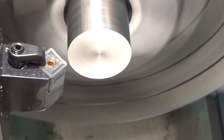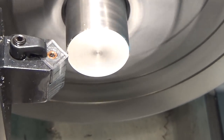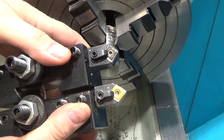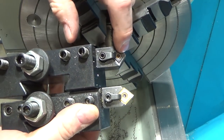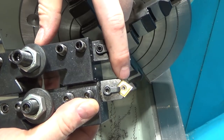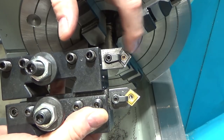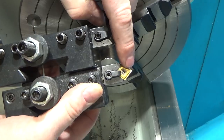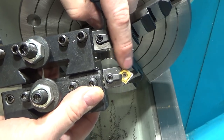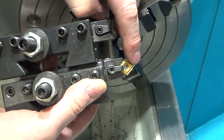A little bit of chamfer. By the way, if you're interested, I have two different style chamfer cutters, different angles on each. And the advantage of this one is if I ruin the tips, it's the same cutter rotated to the unused side. So I can use the exact same inserts and use a different side, which is really handy. But they are different angles because I think this is maybe 70. So that would make this side 110 if that's what it is. It might be an 82.